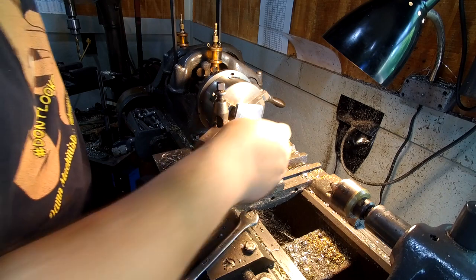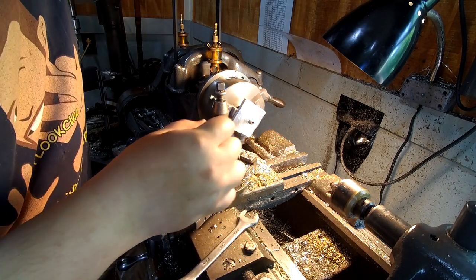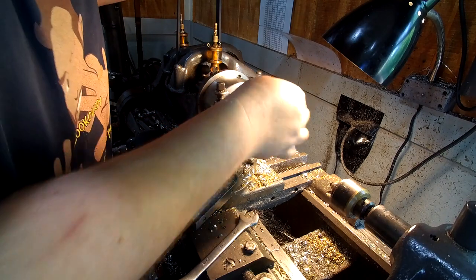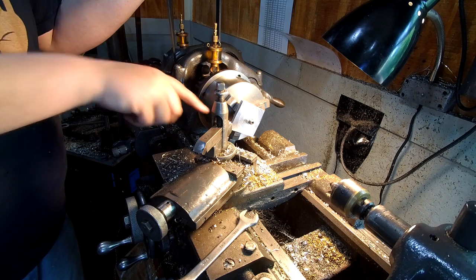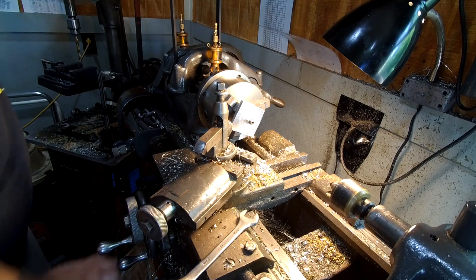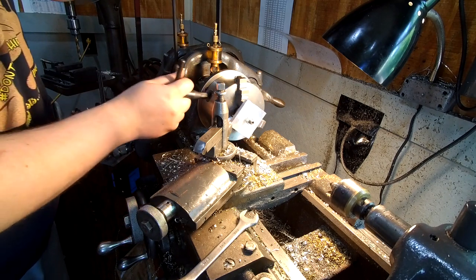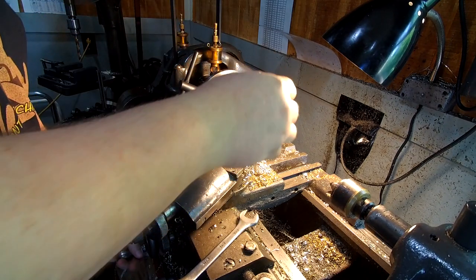That should do. I'll clean it up afterwards. I'm just trying to get all the booger marks out of it from welding and stuff, because I'll use a high-speed steel on it to tool on it rather than the carbide, then I'll get a better finish. For now though, pull this out and start rounding it up. I need a little over 1.25 inches.